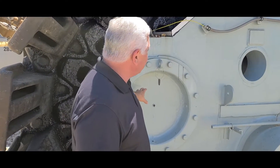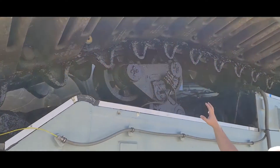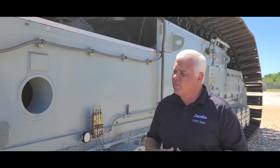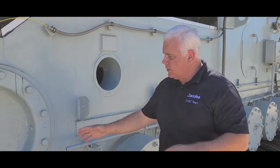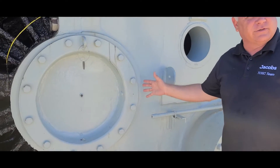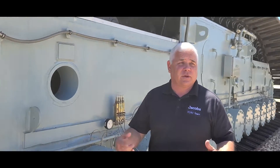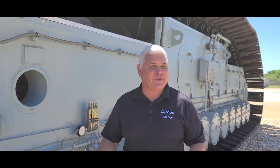This is the sprocket shaft assembly, representing the fourth intermediate. The first intermediate above is a 168-to-1 gear ratio. We went back and lined these up with a laser tracker — back in the day they didn't have anything like that. We found them about 40 to 50 thousandths out, so we had to rebuild them, weld them back up, and true them with a laser tracker. It's kind of better than new now with all the new bearings.